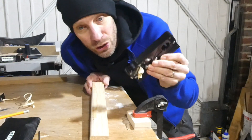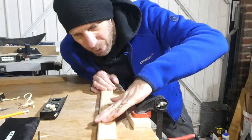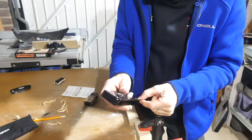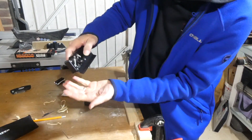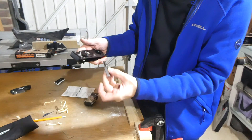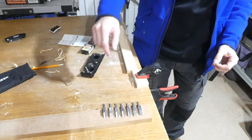That is quite impressive - so far so good. It's a tiny bit bumpy, only a tiny bit - you can only notice it when you feel it, you can't see it. Apart from that, that is spot on. Right, let's change the blade and try something else. The allen key is only to remove the guide - we don't need it to change the blade. All we need to do is undo this knob, turn this, and if we continue to turn it we push the blade further and further out until it eventually drops out. You can see it's got a threaded end - that's basically how it moves in and out of the plane.